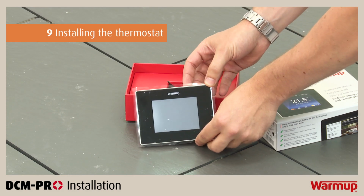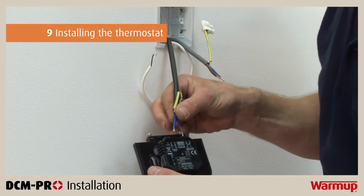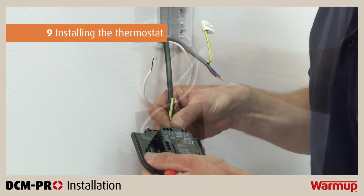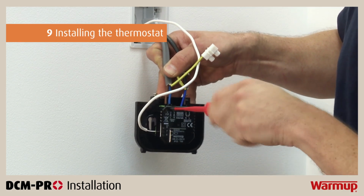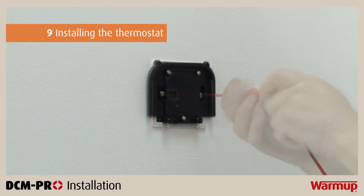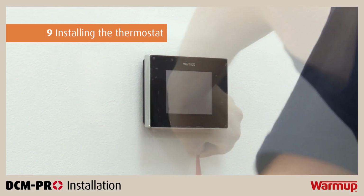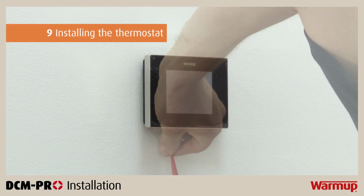Before you install your thermostat, make sure you isolate the power supply to the thermostat. Wire the thermostat as per the wiring diagram in your thermostat installation manual. The power supply, heating cable and floor sensor will have to be wired into the terminals at the back of the thermostat. Once correctly wired, reattach the front housing and screw both closing screws to secure the face and complete your installation.